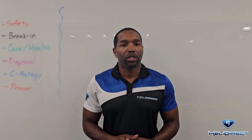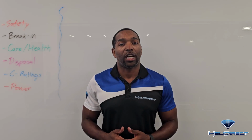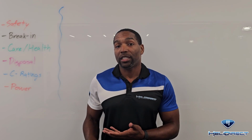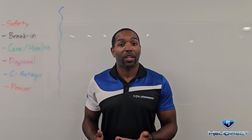So what about high voltage batteries? What's the benefit? Well, the main benefit is longer flight time. Because you're able to take the voltage higher, you're able to get a higher capacity for the same size battery. The C rating stays the same. So you can either get a longer flight time for the same weight or the same flight time and save a little weight.